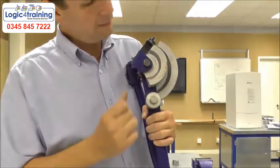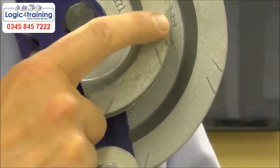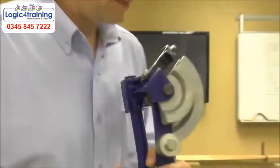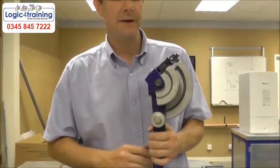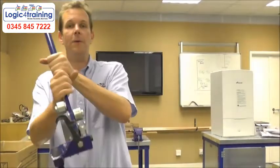On the former there are three marks. The furthest mark is 90 degrees, this one's 45 degrees, and this one for some reason is 22.5 degrees. So what we're going to do is pull the bend to this line just here — the 90 degree. If you've got benders and you've never used them, they are quite awkward.